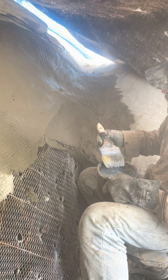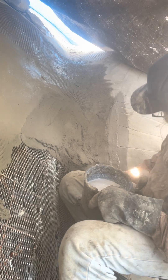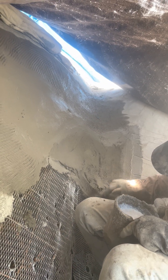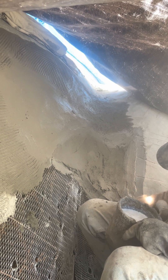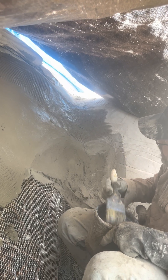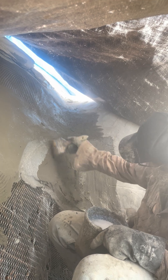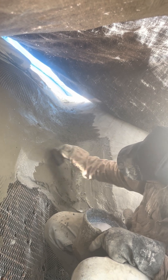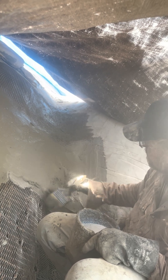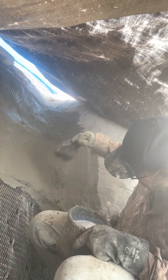When you brush in, get your dry-wet seam first — just go above it if you're letting it run in. Get your other seams next, just get in the very bottom edge of it first. It doesn't take much from the glue, because once it starts mixing with the surface it becomes like a paste that you work over the whole deal.